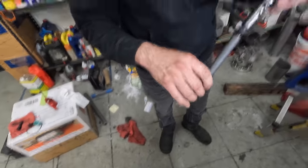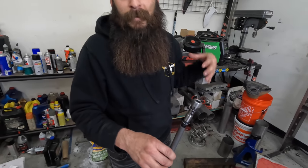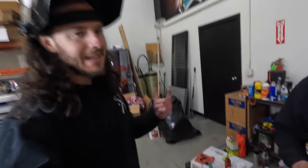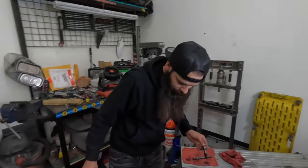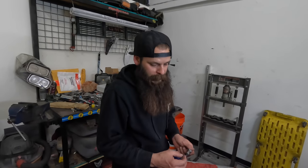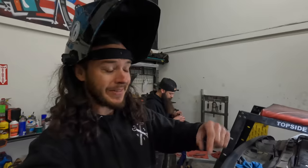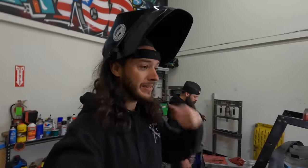So what happens is it's trying to fill the tube, and it's just bleeding out of there instead of going up and filling the rest of everything with pressure. Gotcha. And if it gets big enough, you have a crank no start because there's not enough RPM to make the volume to make the pressure to start the car. So it's not that the 6.0 never ran, it's that it wouldn't start, or it was a hard start. Either the thing would fire up, granted the numbers were off, like it was working really hard to run. If you were to try to drive it, it would either continue to blow the O-ring out until it quit running, or you would be like, dude, this thing's a dog. Now that the O-ring's fixed, she builds the pressure she needs to see on the number side for the thing to say, okay, go ahead and kick over.